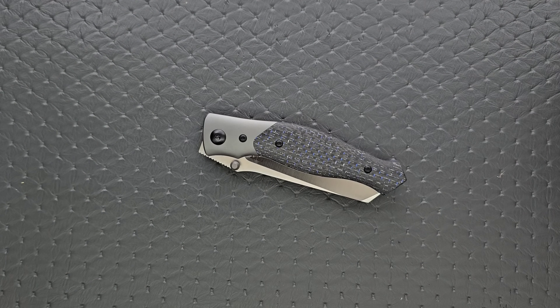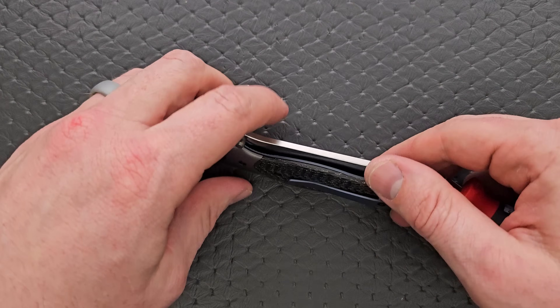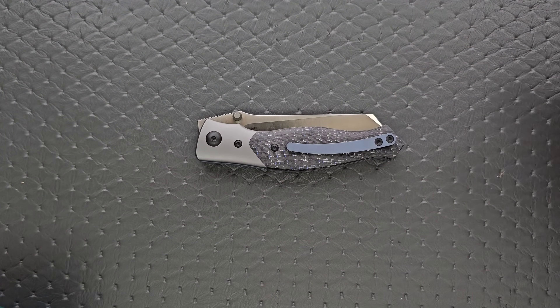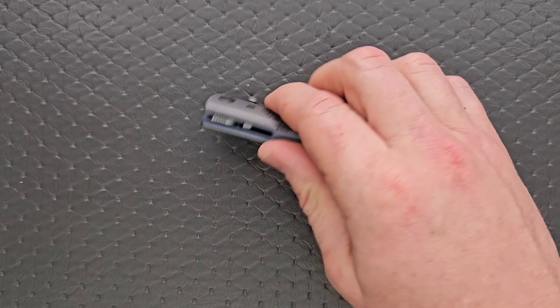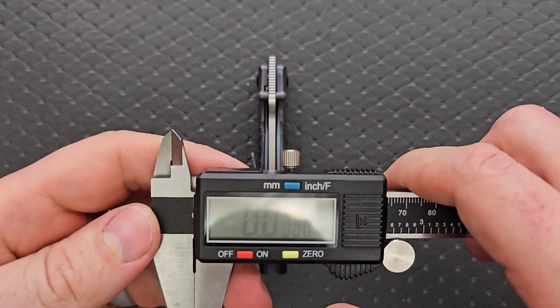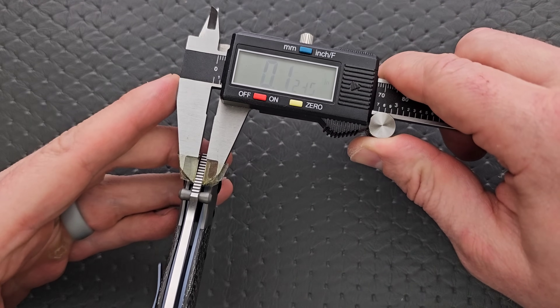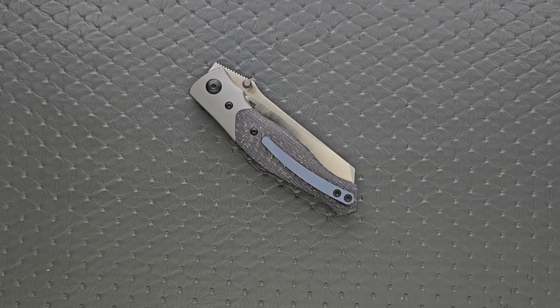It's not a deal breaker — it's more hardware than I love and smaller head sizes than I typically love. But once you get those fasteners out, it's very simple, straightforward, and very easy to maintain and put back together, as long as you have the right tools. Let's measure blade stock thickness — we have about 123.5 thousandths, probably 125 thousandths, which is about what I expect.